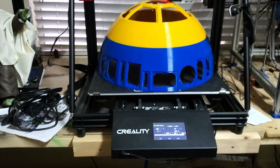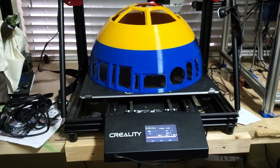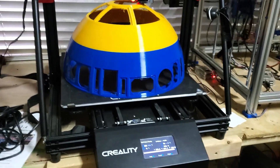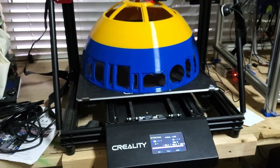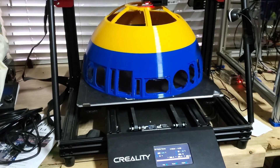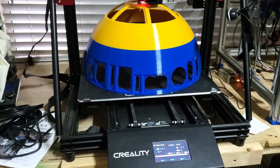I had a few problems with my PETG stringing quite a bit, so David Petzel gave me a few tweaks on my slicer settings to improve it. I still have some minor stringing and a few little boogers here and there, but it's not a big deal. I started printing last Thursday night and today is Wednesday the following week in the morning, so it's like a six-day print. My layers were 644, six solid bottom and perimeter with about 25% infill, but as it goes up it's basically solid, and it's been a great print.